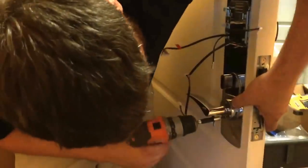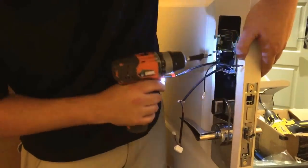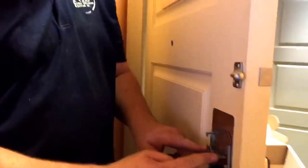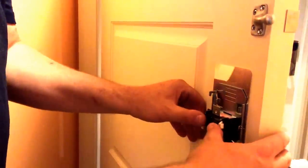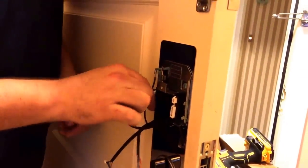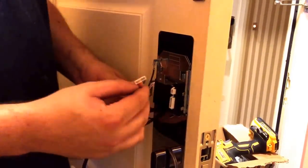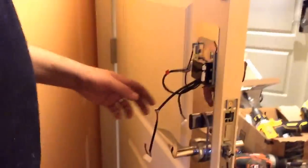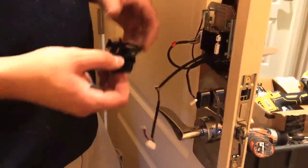Now that we've gotten everything straight, go ahead and tighten these down. This is the LCA — this is where you plug everything in, all these wires. You've got two little hooks up top; slide it right on there. Bring these wires down and it just slides and sits on there. Bring this around — you've got a ground wire up here. This is the lock case wire. Generally just the reader would plug in here, but because we have the BLE and online, we use this longer adapter cable to tie the Zigbee board and the BLE board all together.